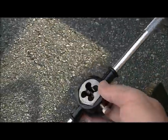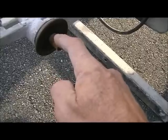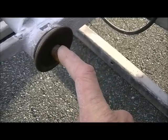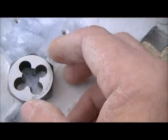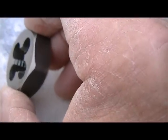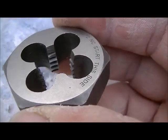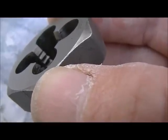What I have is called a die, and this is the handle for the die. I originally ended up with a 5/8ths — the nut that went on there is a 5/8ths nut, which means the threads are 5/8ths. The next step down is 9/16ths, and I got a die for that. It's a very hard piece of steel with thread cutters inside. On the back side the threads start right away, while on the front side there's about a quarter-inch taper to start onto.